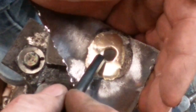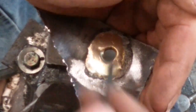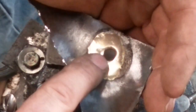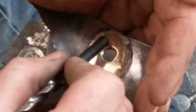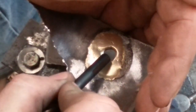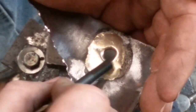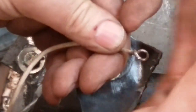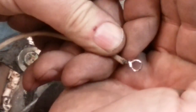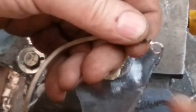If this was on a trailer I'd try to do this on the back side. Go somewhere with a good selection of nuts and bolts — Fastenal has everything — and get some stainless steel star washers, because that star washer will bite into the brass. Get stainless steel or brass nuts so they won't corrode. Combine that ground point with a soldered eyelet and you've really got a long-lasting ground connection that's not going to fail.